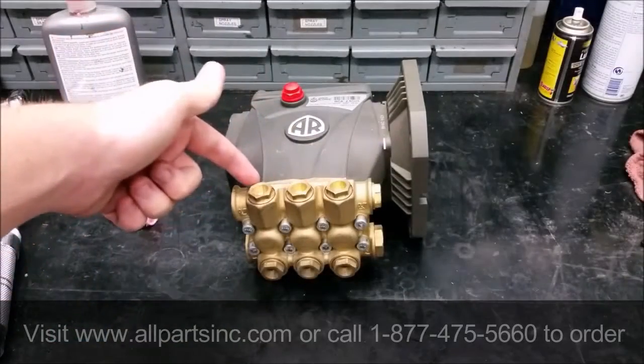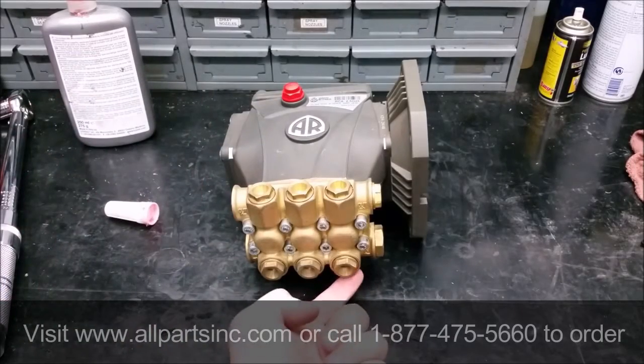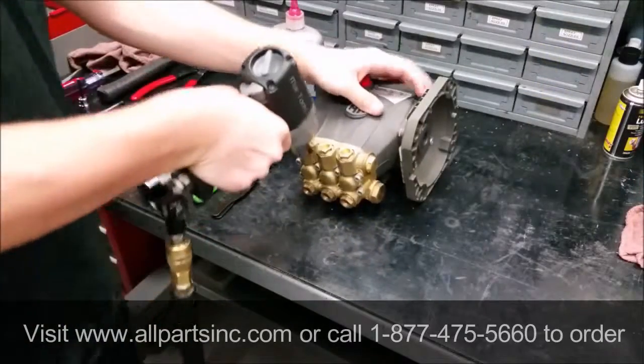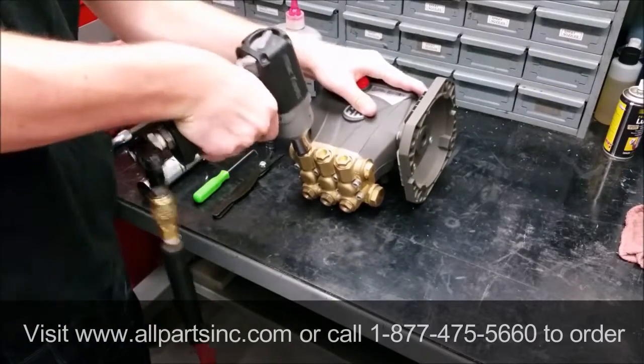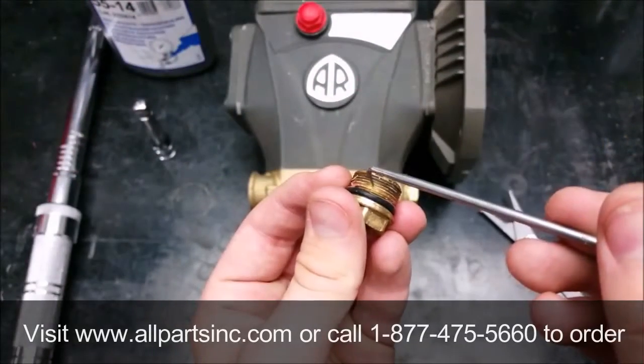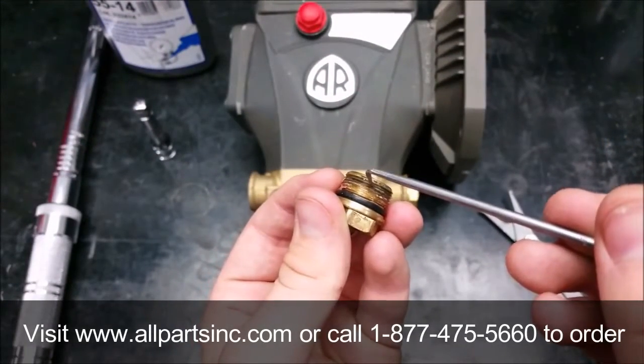Both the discharge and inlet valves are the same, so I will only show the replacement of one of the valves. To remove the 6 valve caps on the manifold, use a 17mm hex socket. Clean the valve caps and any thread adhesive.